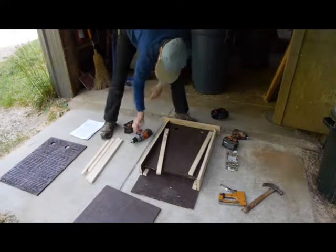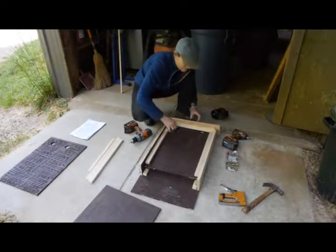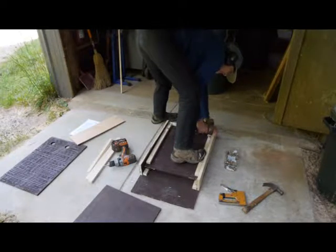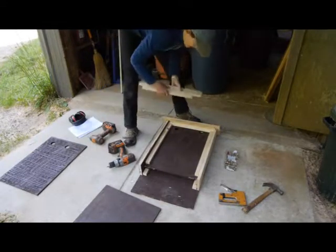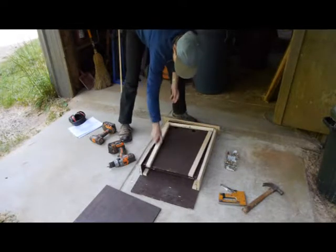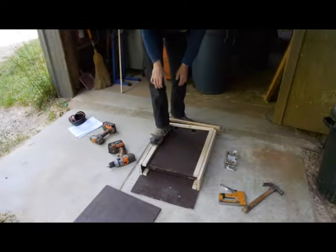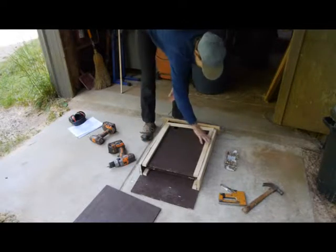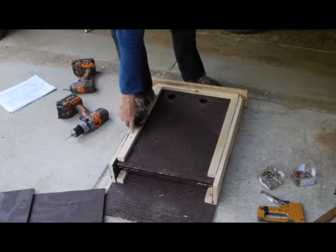Two sides and a beveled back — bevel going against the roof piece — just like that, screwing it in on the sides. Now we're doing the very same thing for the last partition, and the last supports for the front. It's a good idea to put some weight on it since these boards can warp a bit. We push the top down and now we've got all three partitions. We stepped on it to screw it as flush as possible.